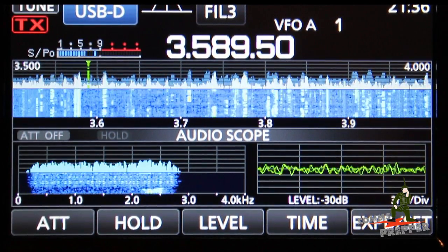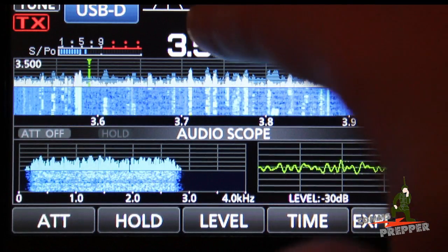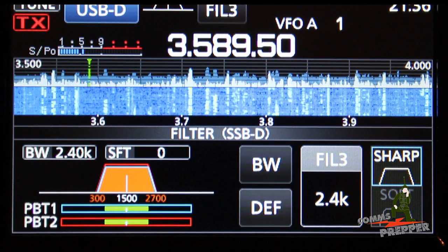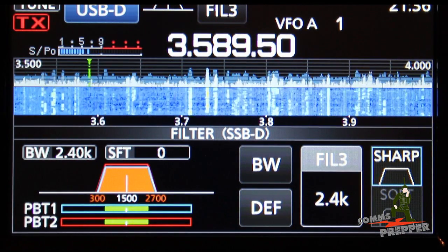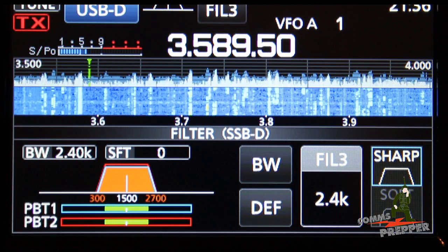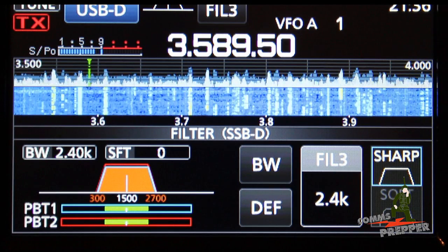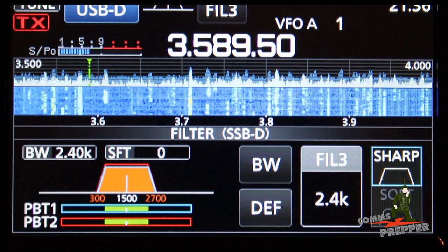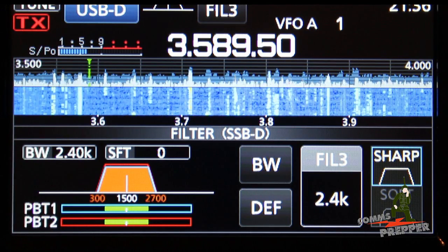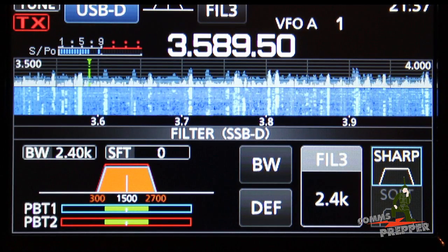That's a quick lesson on how you can set up your digital modem to connect to your ICOM IC7300. There's not a whole lot to it: check your power, check your bandwidth, make sure you have the right filter, make sure you set it to data mode, and of course use the right cable. The cable I'm using I got from Farallon Electronics — I'll put a link below — and Hammaker Parts also makes cables. Remember to turn your power down to 50% and make sure all digital signal processing and compression are turned off. Thanks for watching — this has been the Comms Prepper on how to set up your SCS Pactor modem to talk to your ICOM IC7300.